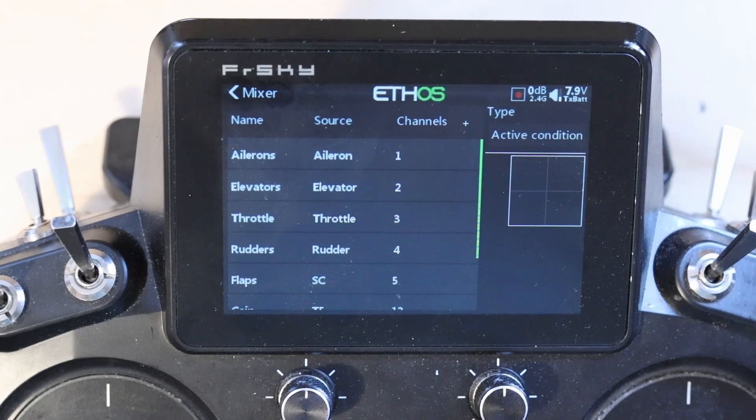There's not a second set of gains for panic — with one caveat: you can have two separate master gains. You can have low base gains in self-level mode and then a separate gain setting for panic where you're actually changing the gain channel value, the master gain. But we're not going to get into that. What we're going to do is simply go over: how do you get panic back?